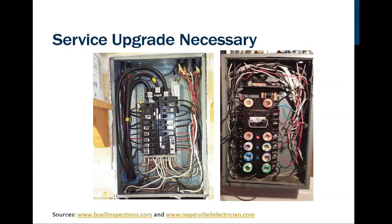this is actually a, we can see that the two hot leads are to the left and the right. This one with the yellow tape on it serves as the neutral. This is not a three-phase connection. This is just split phase, as we would call it, right? And so this yellow wire ends up tied to all of these connections down here, both the white ones that are shown up here and the yellow ones.